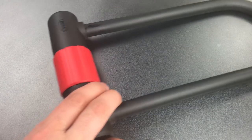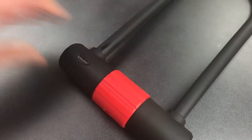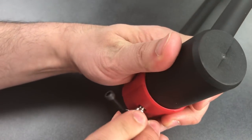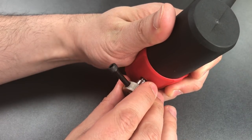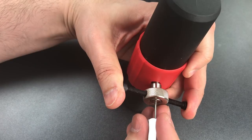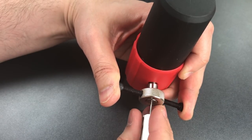All that said, let's get this open. The first thing we do is rotate all of those discs as far clockwise as they will go. Then let me insert this pick — I'm going to use the one that I have not shown you before. Let's make sure I only have disc one picked up. Okay, I think I've got disc one. Okay, disc two is binding. I think we got a click out of him. He feels set.